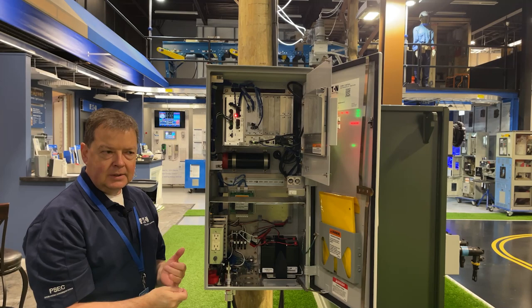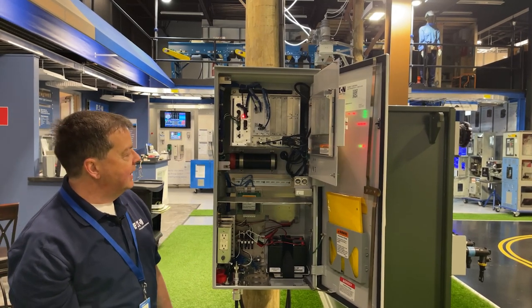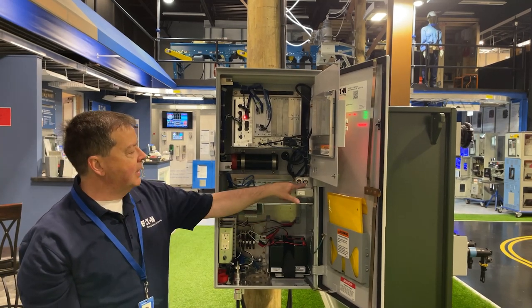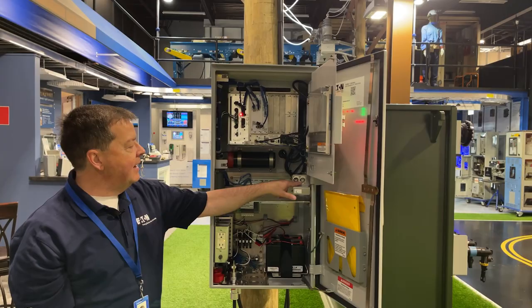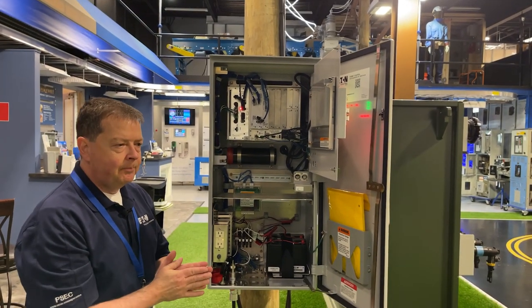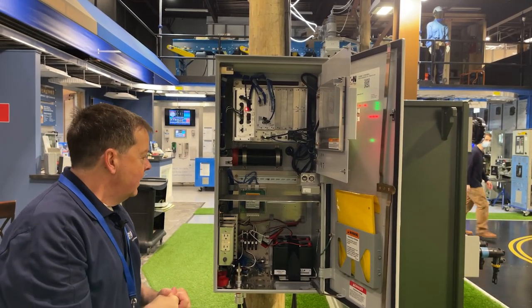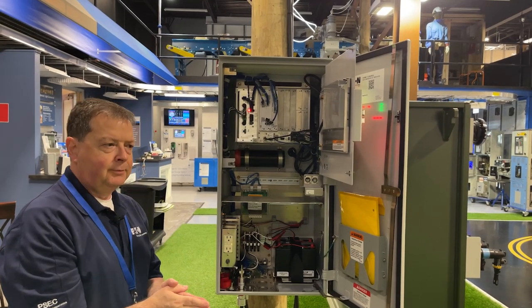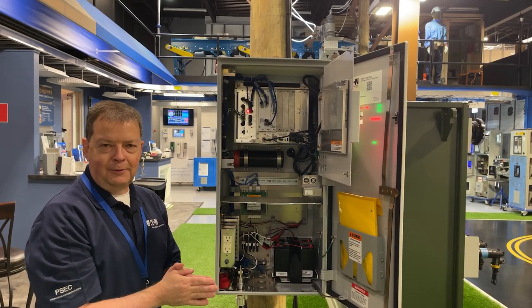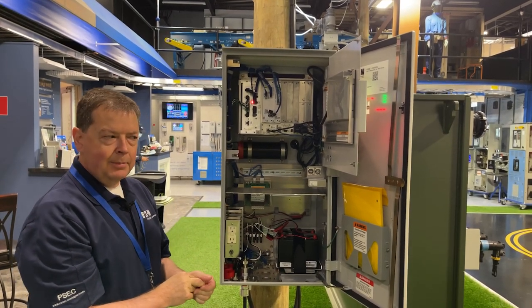From a communication standpoint, as standard the control comes with RS-232 and also an RJ-45 Ethernet port. For local connection with a laptop, there is a USB connection for software programming and using a memory stick to save data out of the device. Memory is greatly enhanced — the control can record over 1,500 different events and has oscillography and data gathering capability.